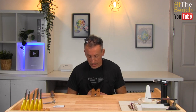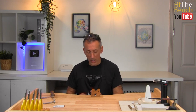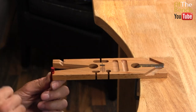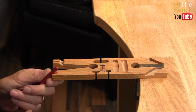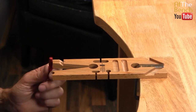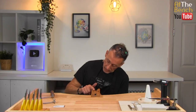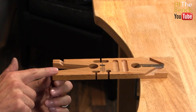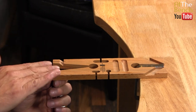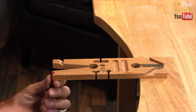It's also got a little groove on the end here, which is very handy. If we had a rod — a piece of silver, gold or copper — we could locate it in this end groove to enable us to file it nice and flat at whatever angle we want. That stops it from falling off. Without this, the piece could easily slip off. We can also bring it right down level with the surface to ensure a nice flat, 90-degree edge on the metal we're holding.